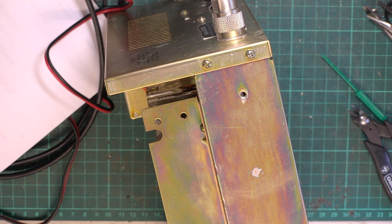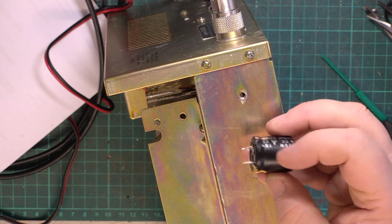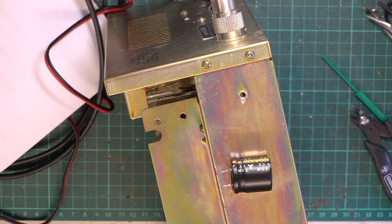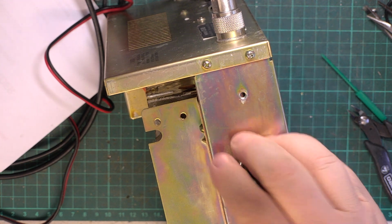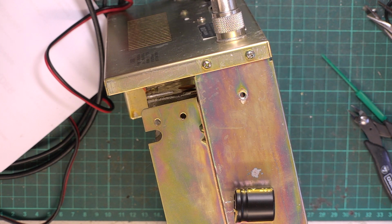But that's really frustrating. I got axial. You know when the leads come out of the bottom like these, this is what is called radial. When the leads come out from either end, it's called axial. And in days gone by, everything was axial except can electrolytics. We have got some axial ones, but it looks like a bodge when you put those in, and they're more expensive because they're now hard to come by. So although we've got those in stock, they're lots of money.